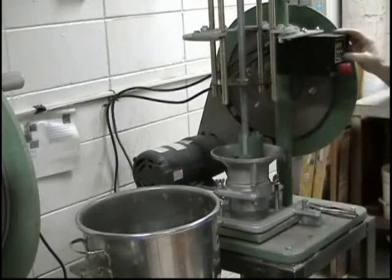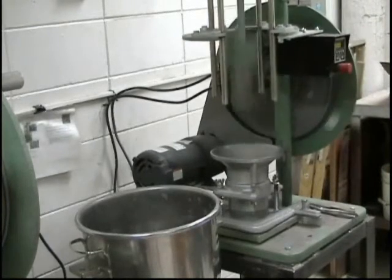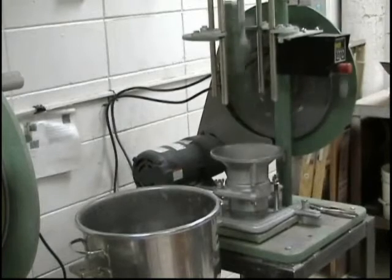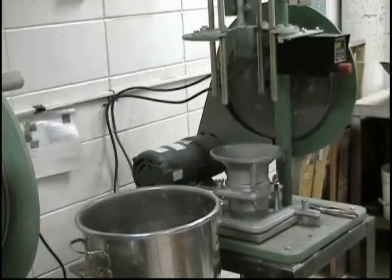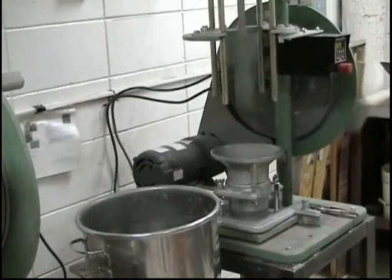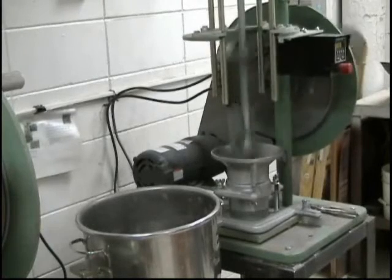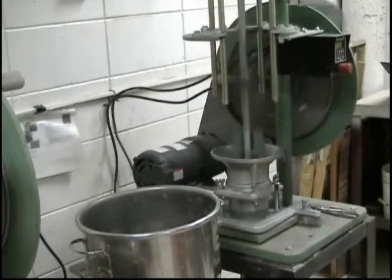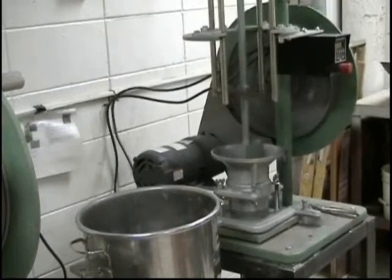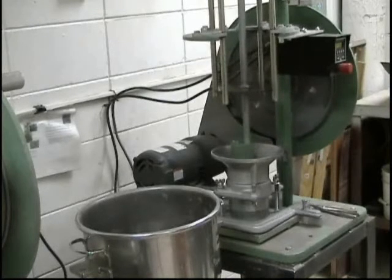Release the hammer and set it down on the soil in the mold. Compact the soil with twenty-five evenly distributed blows of the compaction rammer. In this video, the use of a mechanical rammer is demonstrated. The procedure used with a mechanical rammer is the same as that of a hand-held rammer. However, the mechanical rammer simplifies the process and generally provides a more uniform product at a much faster pace. The mechanical rammer is preset for the correct drop and the number of blows needed for each layer.